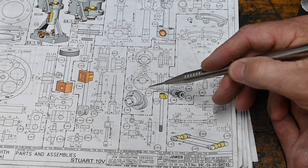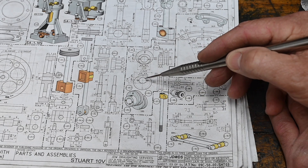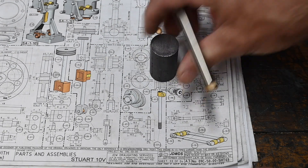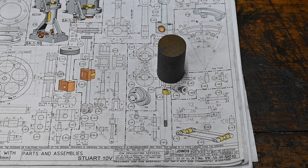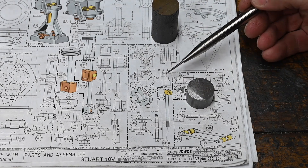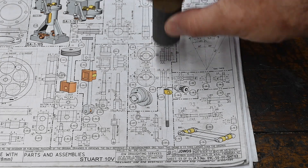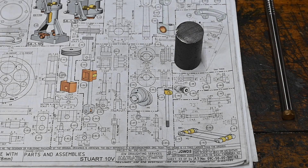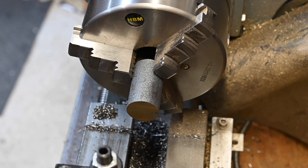Nice and simple — 24 millimetre diameter with a groove in it, and then I'll take it out and drill the hole. I've got a bit of 25 millimetre hot rolled. I would have preferred cold rolled but the biggest bit of cold rolled I've got is only enough for one, so I'll keep it all the same and make it out of this hot rolled mild steel. I'm just going to give it a bit of a clean up first — get rid of the mill scale.